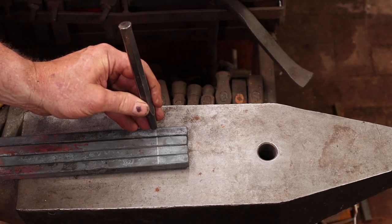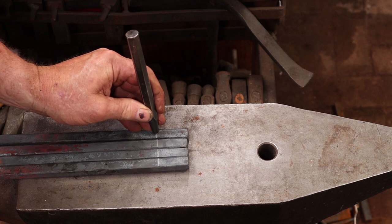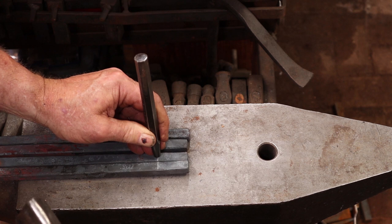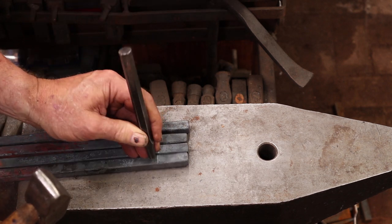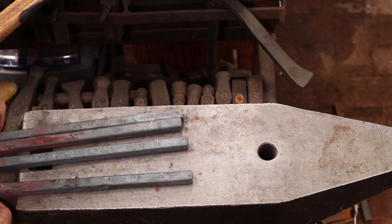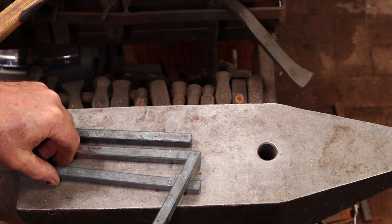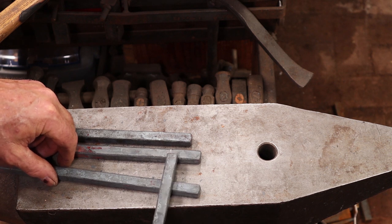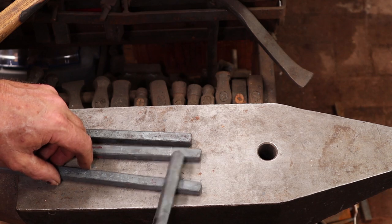So I'll put a simple mark there, and now I'm going to center-punch mark these. If you have a square-pointed center punch, it will be easier to find this when the piece is hot in the fire. So we just want to put a nice center-punch mark on each of these. When it comes time to forge the actual half-lap joint, the center-punch marks will come together — you just have to be good at lining those up, and that's how we'll line these up to forge the joint.